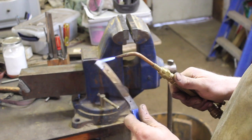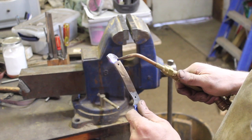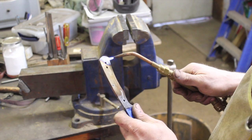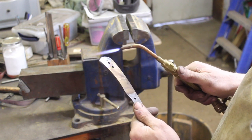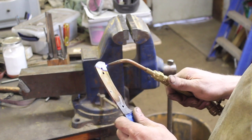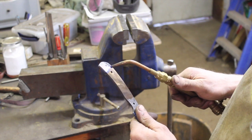The reason for this is we don't want to change it to austenite. Austenite is a phase of steel that happens above 1400 degrees, usually 1425 and above, and once we've created some austenite that can change back into pearlite — and we don't want that to happen. We just want to use some heat to ball up or segregate the carbon.